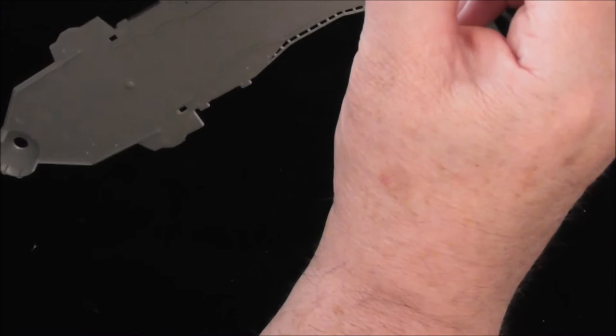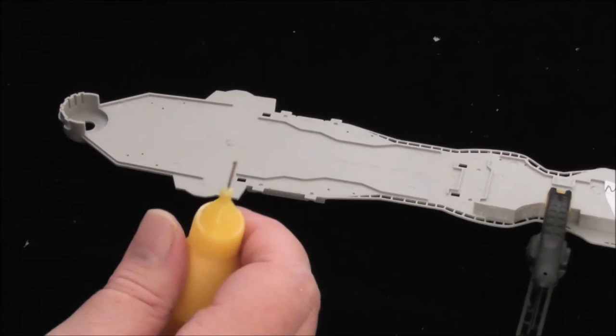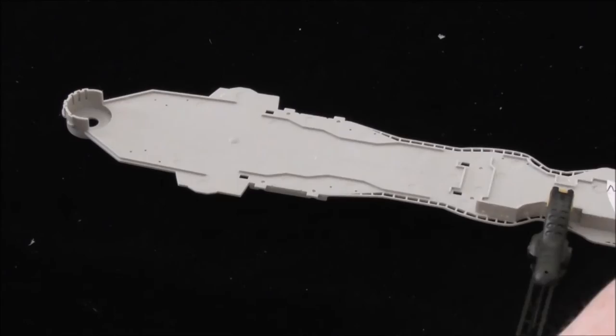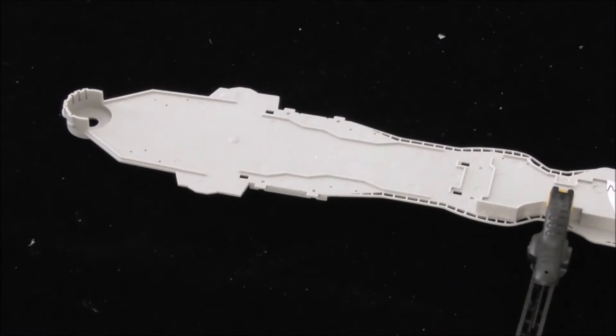There, there, and there. Now, we'll let that set, and we won't do any more to that piece until that is set properly. Then we'll take the clamp off, then we can work out towards the outside, and knowing that that is accurate, and because we've done a test fit, we know that this will be accurate and that will be accurate. So we'll come back shortly and complete the operation.